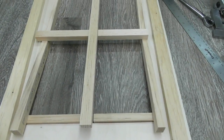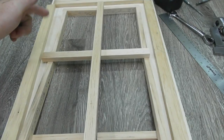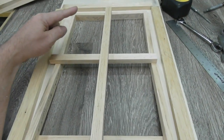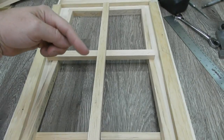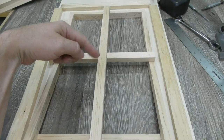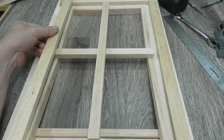I lost the sun so I'll do that arch on another day. I'm turning my attention to the small window. I've got things laid out — these were originally just rough cut. I need to take all these pieces that go around the perimeter and cut them to the thickness of the plywood. This will have a half-lap in the middle for the horizontal and vertical divide, and then this is the trim material that will frame it out.